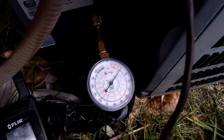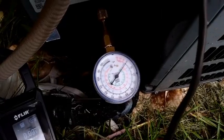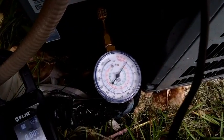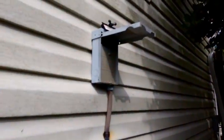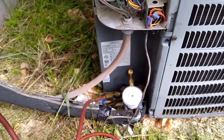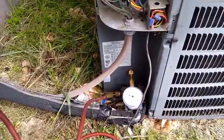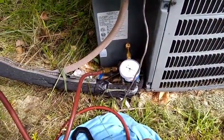Well, it doesn't get much less than zero — we definitely have an issue there. I'm going to put some nitrogen gas on it and see what we can find as far as leaks. We're up near about 50 pounds. Make sure you pull that disconnect too if you're going to try that, because if you still have a cooling call and you put nitrogen in it, the low-pressure switch is going to close and it's going to start running — which will not be good. So don't forget that.